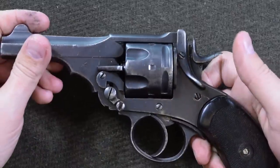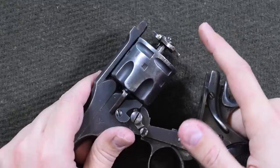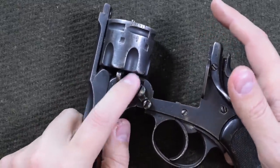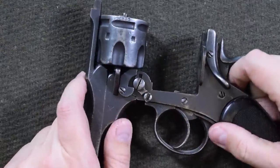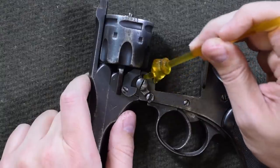So when this is closed. Now, obviously, as I open it, there's spring tension because this is popping out, and yet the cylinder doesn't go shooting out of the gun. And the reason for that is a yoke that allows it to be floated when closed and then snatches up on a little ring in there whenever we open the gun. Now that is driven by this contour here in this spud at the end of this little arm, okay?